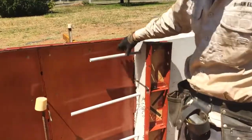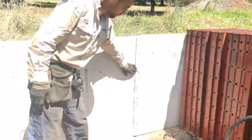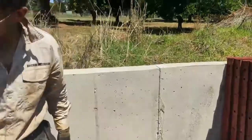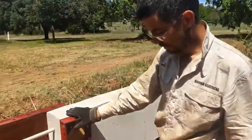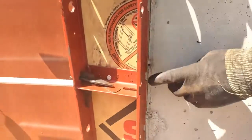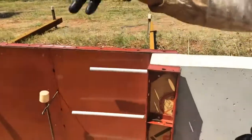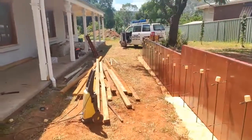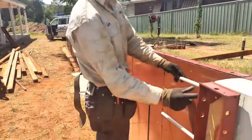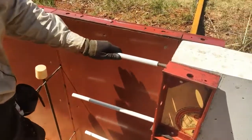Here we're doing a join under the wall — this will be for expansion. We'll have a saw cut there, similar to this. This was a pretty bad connection here that's going to be cleaned up still because it just didn't line up very well. This time we're clamping on, and next time I won't snap ties off — I'll leave those ties there so I can really clamp it on. However, the wall is changing direction slightly because you can see there's a taper under the house. In a minute we'll be tying rods on here, tied on with a two-inch gap so that the wall can slide in and out as it wants to expand and contract.